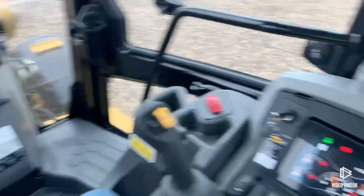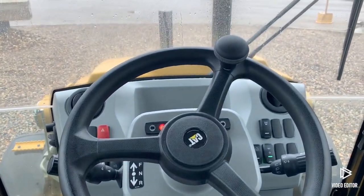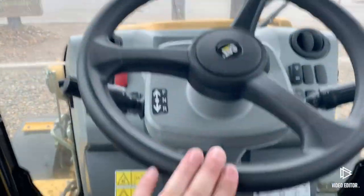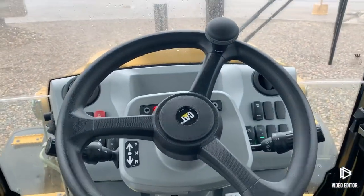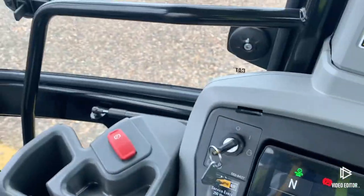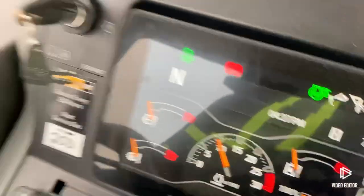We are in the cab of the 420 XE here, sitting facing the front end of the machine with the steering wheel latched down as if we were roading the machine. One important thing to keep in mind: if you've got the steering wheel brought down and you try to pivot your seat backwards before putting that steering wheel up, you'll see a warning light on the dash. As long as that steering wheel is down, you're not going to be able to use your back end. Make sure you get the steering wheel in the fully stowed position before you spin the seat around to face the back end.